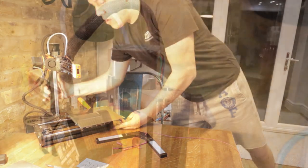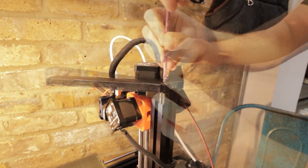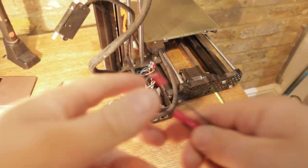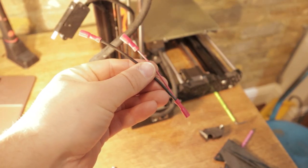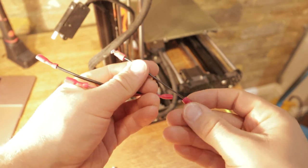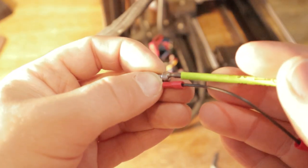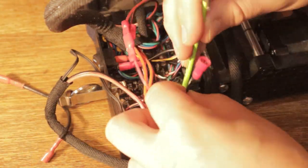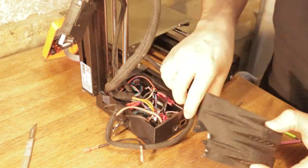We're grabbing the machine — we've now built it and it's time to get it fitted. The two screws at the top come off and we fit the longer ones that come in the kit. Then we go down to the bottom where we need to connect the power and ground for the light into the control power area. In the kit you get two wires — one for ground and one link wire that pulls power from the original point. These fit in really easily. There's a screw for the ground and the power one just presses onto the spade terminals.